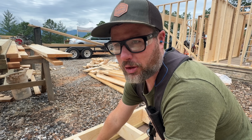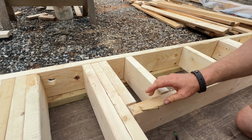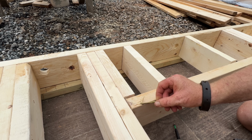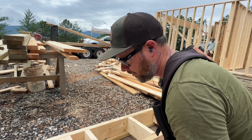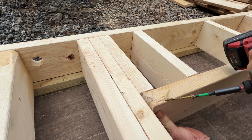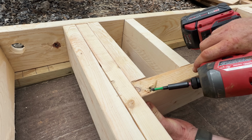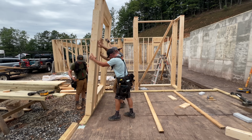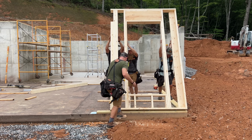I've got what I'd call a little bit of a carpentry trick shot here. I've got a sill plate that needs to get pulled in two directions to be tight against the jack and the cripple. And I've got this screw angled at the angle I think that I can get both of those accomplished at the same time, drawing both directions. So I'm gonna lift it up a guess amount here to give it room to draw and give it a shot. And I got it. Oh, yeah. See what I'm saying now? Nope, don't see it. Believe it or not.